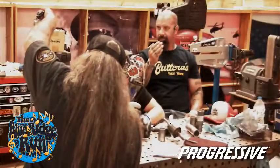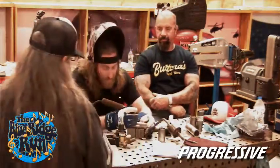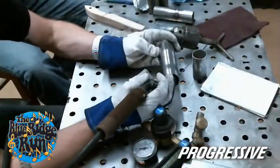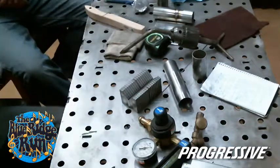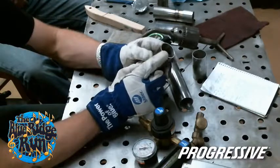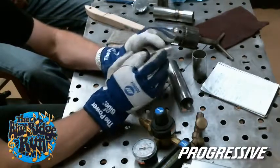I don't think I'll be able to get it to blow out. I'll try, though. Nope. So with proper fitment, it's almost impossible to actually blow it out, but I'll set one together. Another thing we can go over is prepping your cut edges, because burrs will actually melt away faster and cause problems than the actual parent metal.